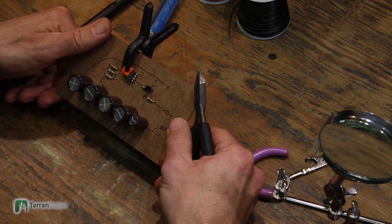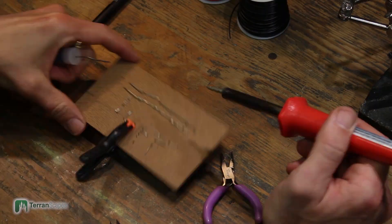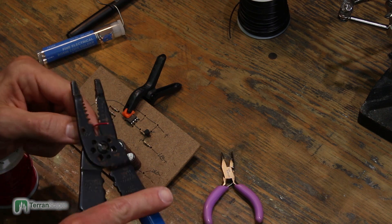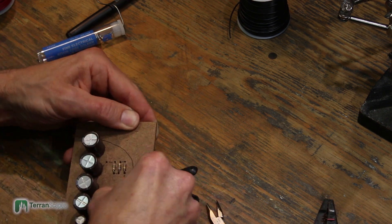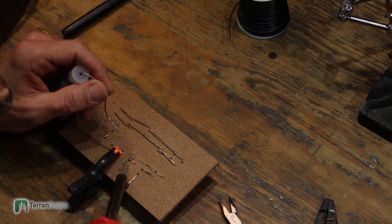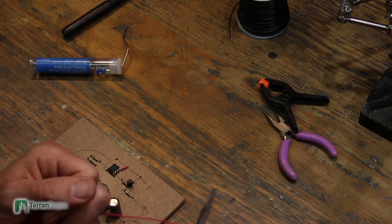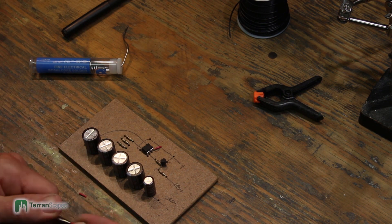Here I've put in all the capacitors. Because I want a very slow flashing, I'm running quite a lot of microfarads — about 10,000 microfarads. Those slow down the rate of the fading, so once it starts to change its illumination, the higher your capacitance the slower that fade is. After a lot of playing with it I decided to use that amount.